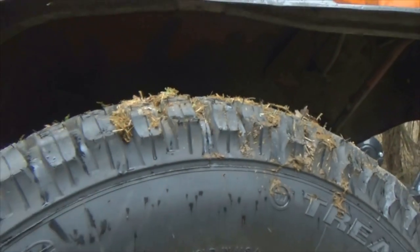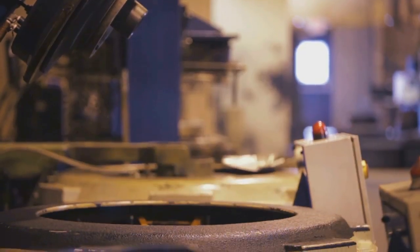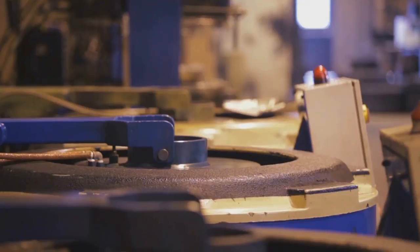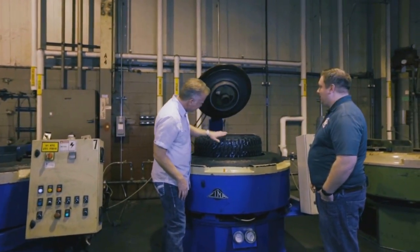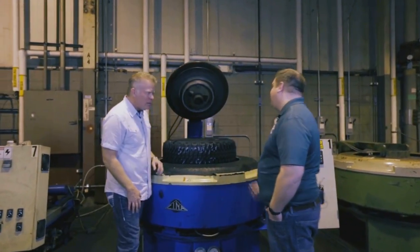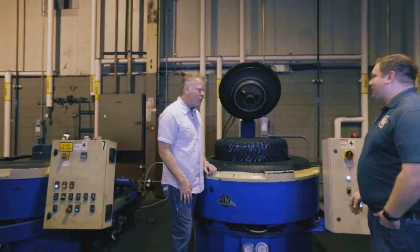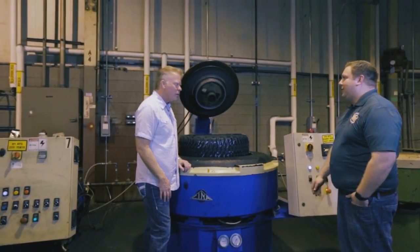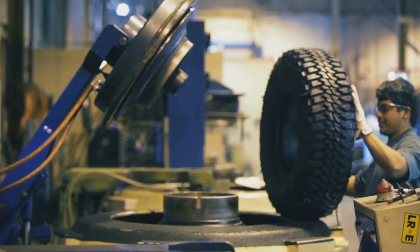This tire has just finished its curing process — this is actually the same tire we just saw that we put veneer on. Look at that tread! It is nice and warm. You need heat, you need pressure, you need time to cure a tire: a little over 300 degrees for 68 minutes and 150 pounds of pressure inside the tube. It's the same curing process they use to make new tires.